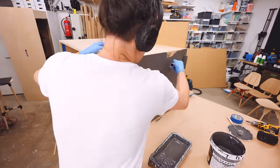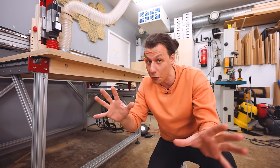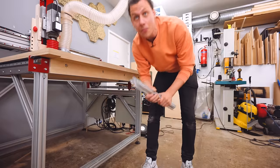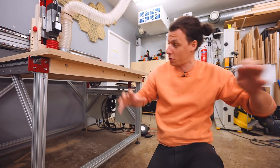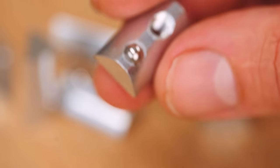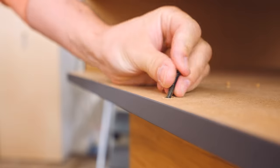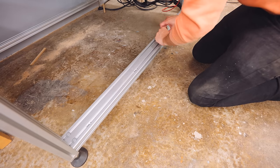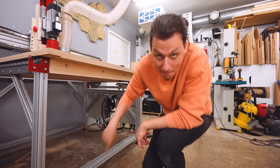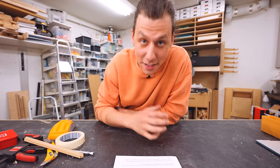It's the day after. This thing is painted and it's time to see if we can fit it underneath here. In preparation, I moved the two aluminum extrusions all the way down and removed the braces that used to be here. I'm going to attach the box to the frame the same way the whole machine is put together — with threaded insert thingies that slide into the T-tracks and into the MDF box. I drilled a bunch of holes, and hopefully all the inserts I've installed in the bottom, sides, and back brace will line up with the holes in the frame. But first, a quick ad from today's sponsor, Skillshare.